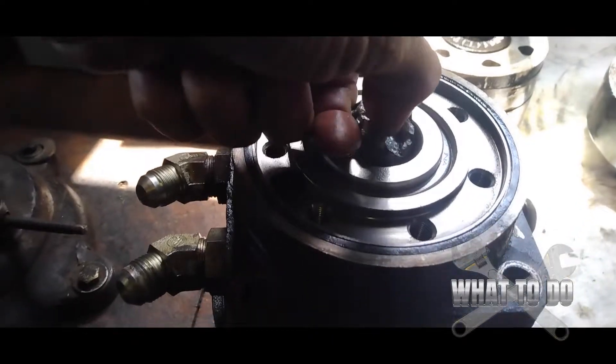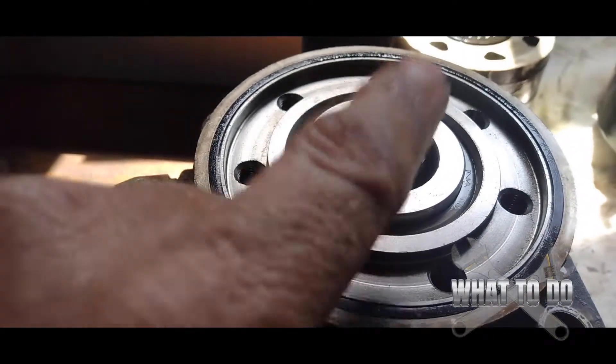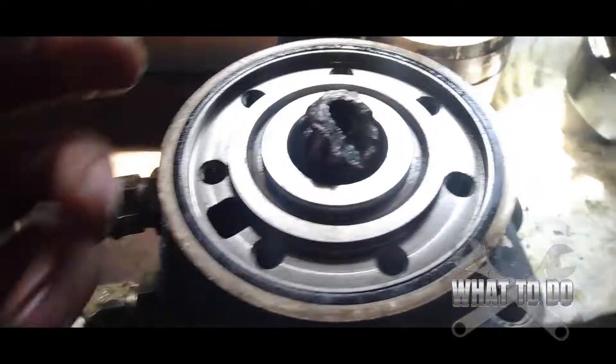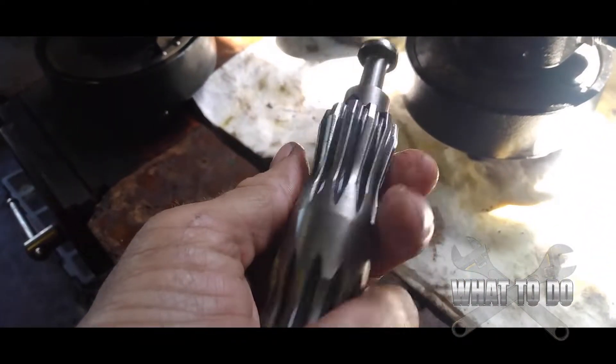If you really want to save money, but typically when a shaft shatters I would just plan on ordering a new pump. However, you can order just the shaft if you don't have too much damage inside and want to do a complete rebuild. I have another one here I wanted to show you — an example of a bearing lockup.